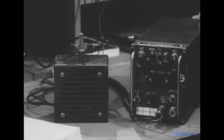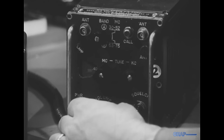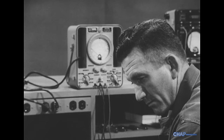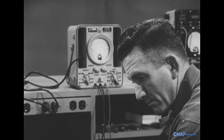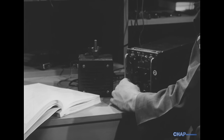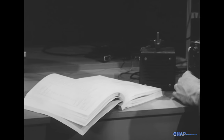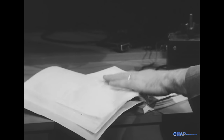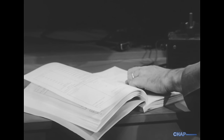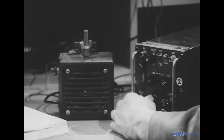Is there a rushing noise? Can it be varied by adjusting the volume control? Or do we hear too much hum? Is the signal weak or distorted? Or do we get nothing at all — a dead receiver? With experience and help from the checklist in the manual, a repairman can quickly interpret these symptoms, very often sectionalizing or even localizing the malfunction without further delay.